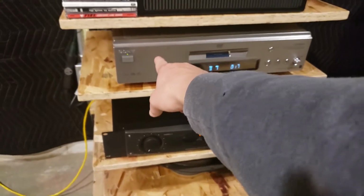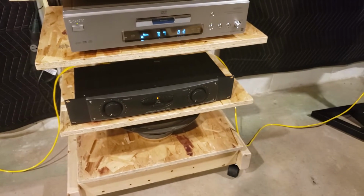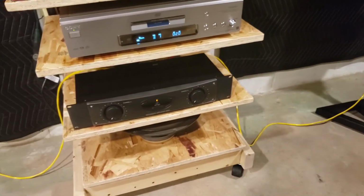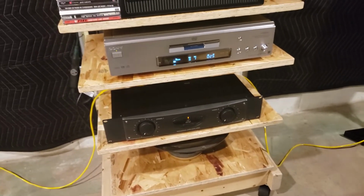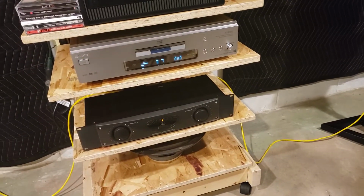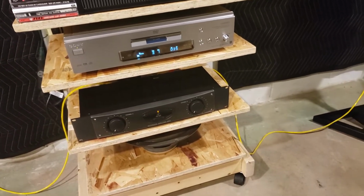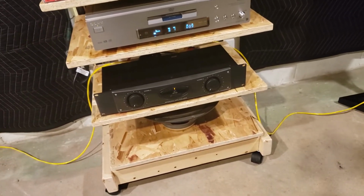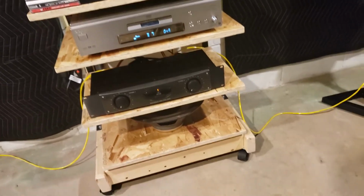This CD player, I believe, does put out 2 volts, but it is a higher quality CD player. So in this case, I think this thing's sensitive enough that even if you were to hook a CD player that is less than 2 volts to it, you would still get plenty of power out of it. Not that I'm recommending it. There's a handful of ways to get your hands on some sort of cheap mini preamp, and maybe I'll list a few in the description, but I think that's it for this little side subject. The next thing you should be seeing is over at the desk. We're going to take a closer look.